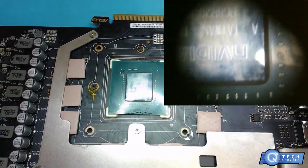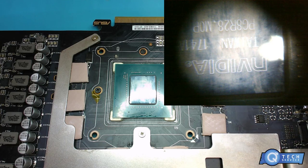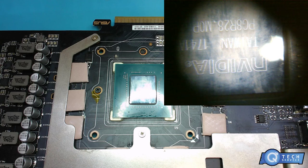Yeah, I don't know about that one, man. I definitely wanna be using this stuff, just because now looking at this, even if liquid did spill down a little bit, or maybe you wanted to rethermal paste it down the road, you might have heat issues just because it's not able to spread the heat evenly between the die package inside the chip. It's gonna drop it down a little bit. It is, and it has to. Maybe by a little bit. Probably won't be anything too much to worry about, but yeah, I'm sure it would.